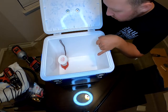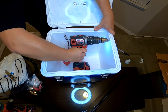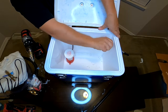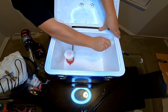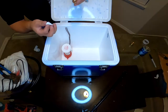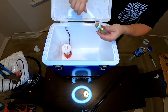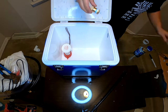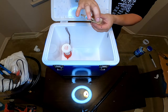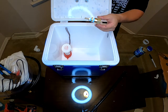So we'll go ahead and start with the three-quarter bulkhead — I want to line it up right in line with the bilge pump. I would really like to make this a nice tight snug fit to where I can actually thread it on, so I know I'm getting the best seal possible. I want it just nice and snug where I don't even need any silicone, but we're going to go ahead and do it anyways. And then we're going to go ahead and put Teflon tape and pipe dope on all of our fittings and pre-make everything that we can. These bushings I'm making here connect from three-quarter from the bilge pump down to quarter-inch for our hose that runs to the shirt. I know this is a little excessive — I could have ordered a three-quarter female by quarter-inch barbed fitting — but it would have had to be online and would have taken up to a week if not longer to get here, so I'm just going to whip this up. No one's really going to notice it anyways.